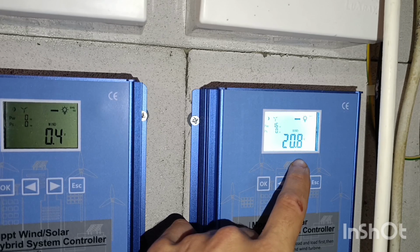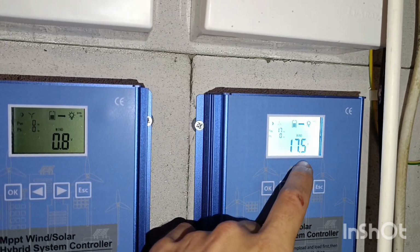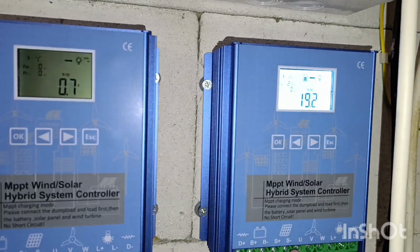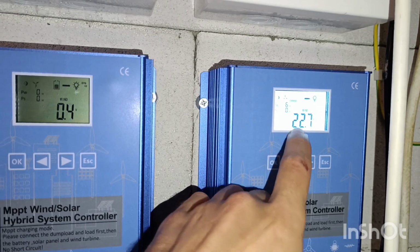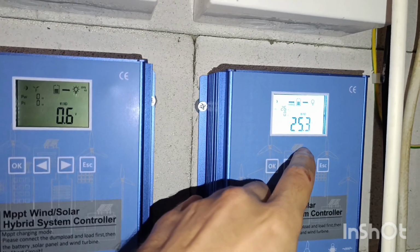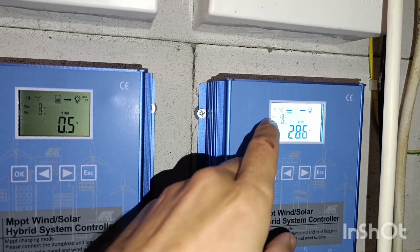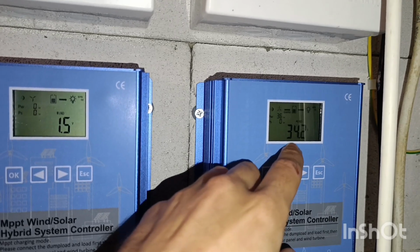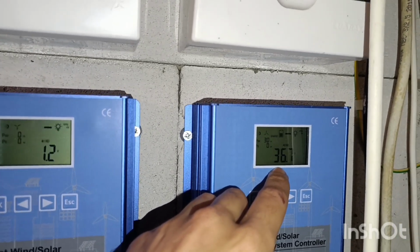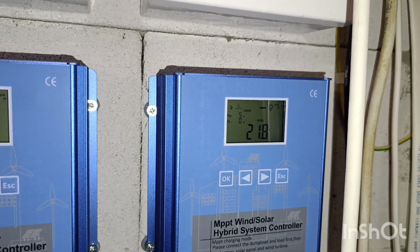99, will it get to 21? Yeah, not 22, you need 22 volts. That's the VDC. On the AC side, it's different. I've been measuring that. And you see, charge appeared after 22. Immediately after 22 volts is reached, the charge appears and it starts showing the correct wattage out of it. And the amount of power it takes out of this wind turbine is quite good. It's quite good for such a small wind turbine. That's an amazing result.